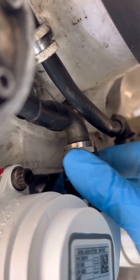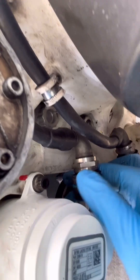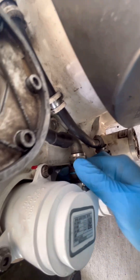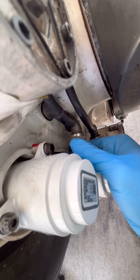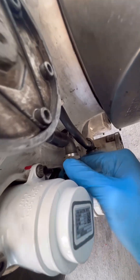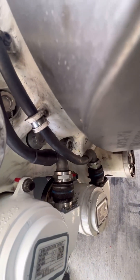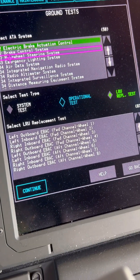After the connector and plug inspection, we connect the connector to the motor. The next step is to properly tighten the electrical connector with the connector plier. At this point, our installation is complete and we prepare for the test.